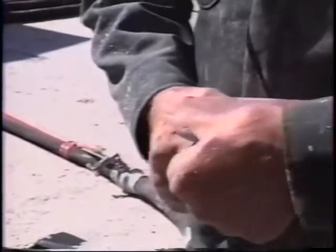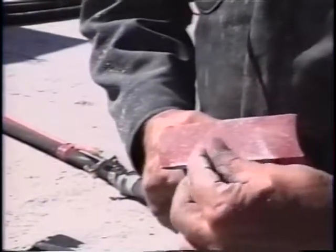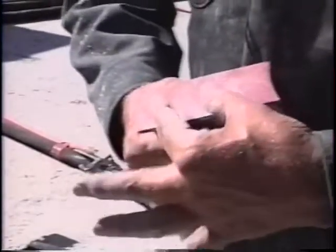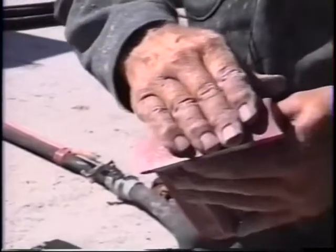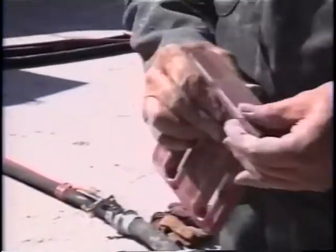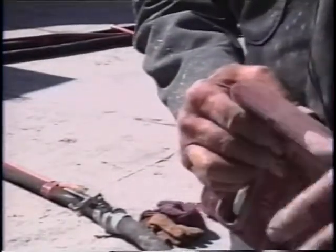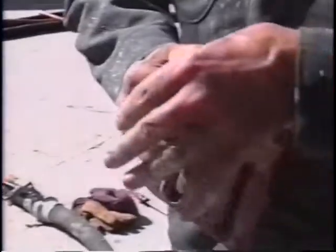And this is very important, though. As this starts to wear, it's better to replace. Here again, it's a very inexpensive part, and much smarter to change this and put a new one on than take a chance and run an old one and let jagged material get in the rubber pads and chew them up, eventually chewing up the steel plate.